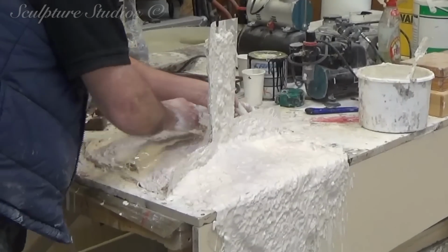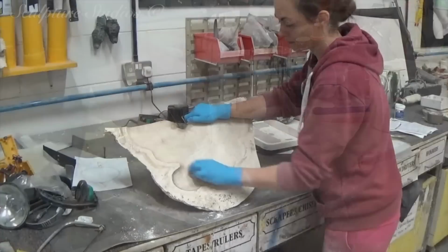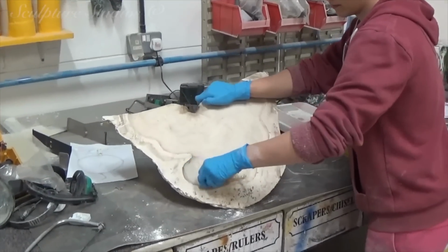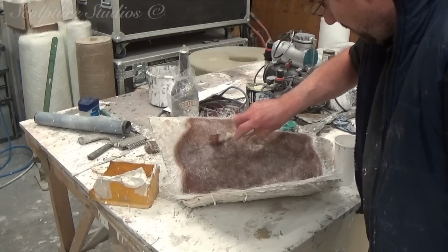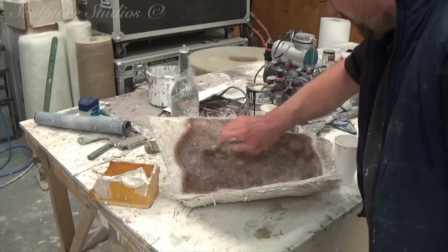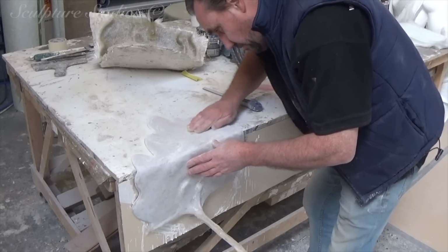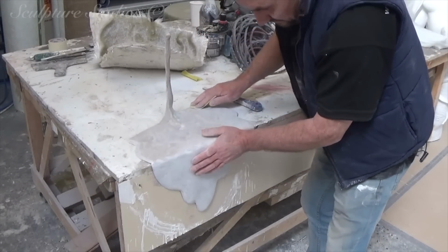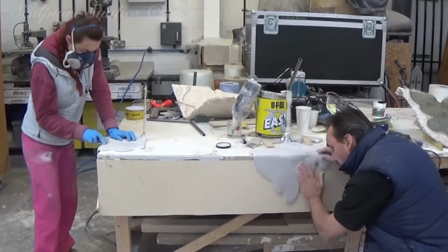With a mould making process such as this, we're always trying to improve the eventual end result every step of the way. We get the clay as smooth as we can with the master pattern, then we clean the interior of the mould a little further once the initial clay pattern's been extracted, and when the casts have been laid up with the gel coat resin and a few layers of glass fibre, these are then cleaned up afterwards to an even better finish. All this cleaning up and sanding on any project takes time, but it's really worth us improving the surface through each stage of the moulding so that we end up with a really high quality result.